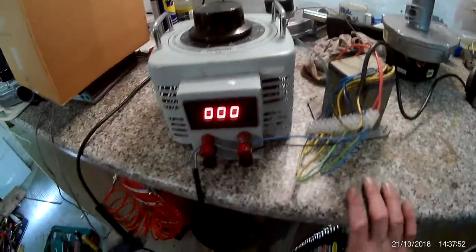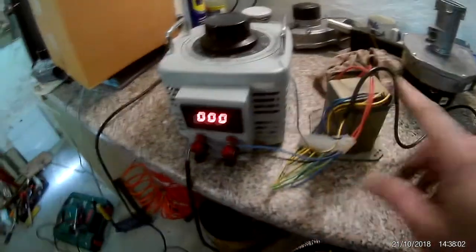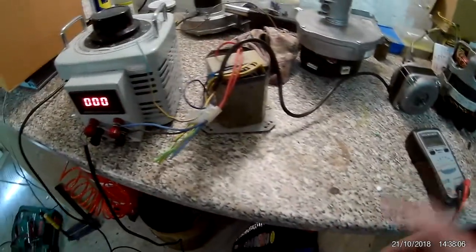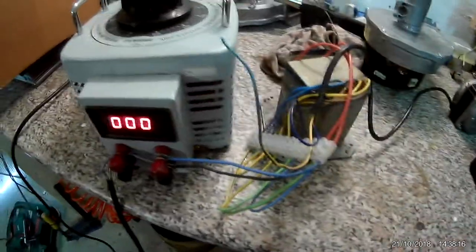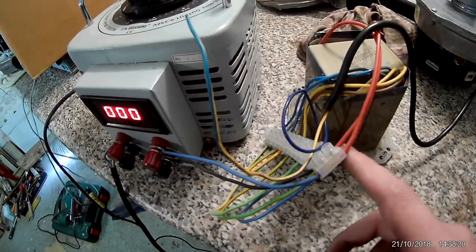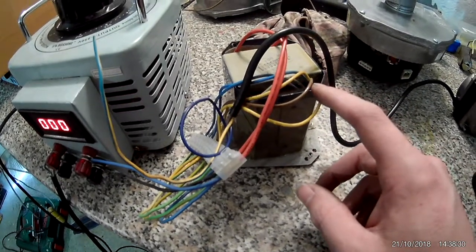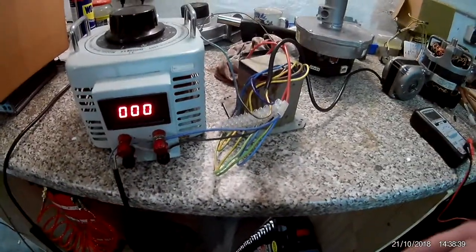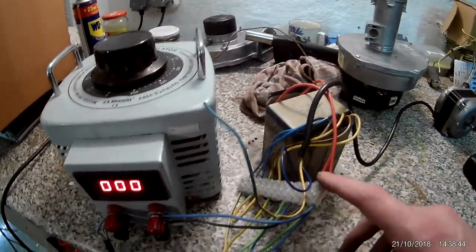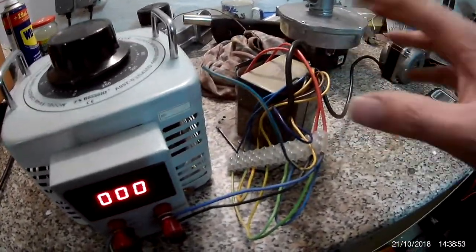We have a variac set to 230V — I could just plug directly in, but for testing I set it to 23V and measured it, then multiply by 10. This transformer is from an old stereo: 230-240V comes in, and there are two center-tapped outputs — one is about 24V, the other around 73V AC. I put those two in series and wired that in series with the main supply, giving roughly 240 plus 74 plus 23, so about 330V total. I confirmed that with the multimeter.